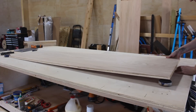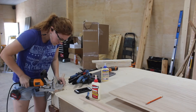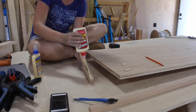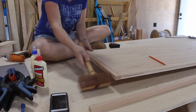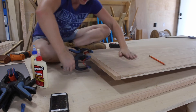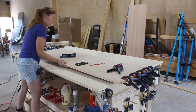With the bottom not being seen except for the edges, I decided to use oak-veneered plywood for the majority, then trim it in solid oak. I cut a piece of ply to size, then propped it up on bench cookies so I could apply the edging, which is just some 1x oak strips. I once again cut in some biscuit slots to make aligning these easier, applied the glue and biscuits, then used the Rockler bandy clamps to apply pressure while that glue dried.